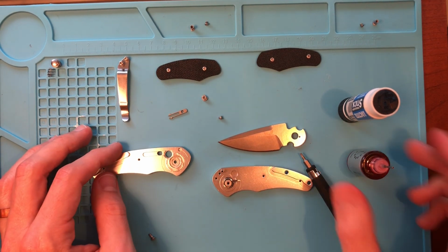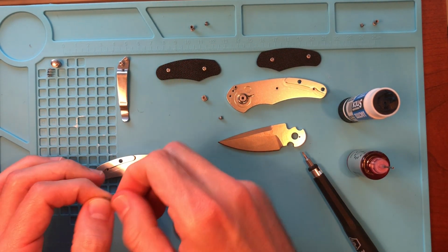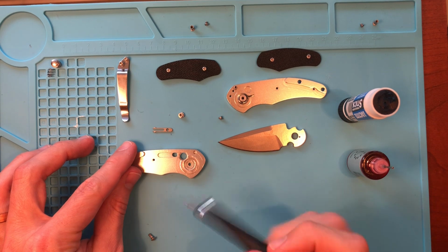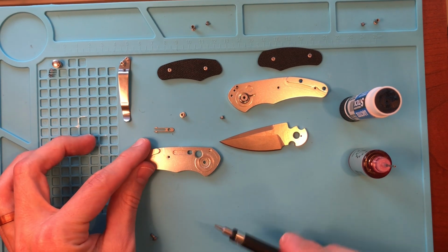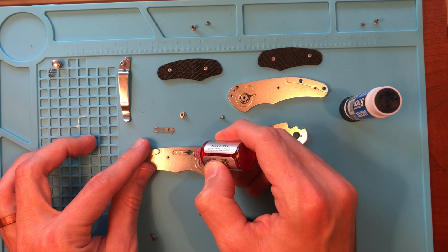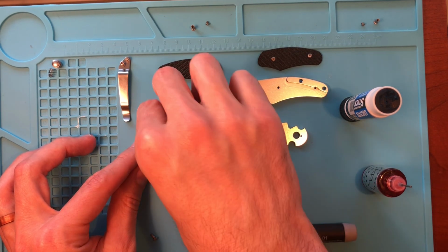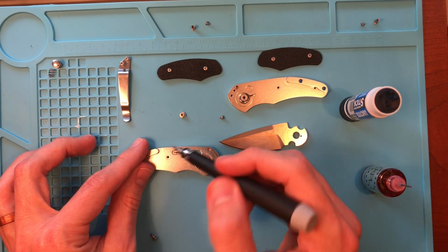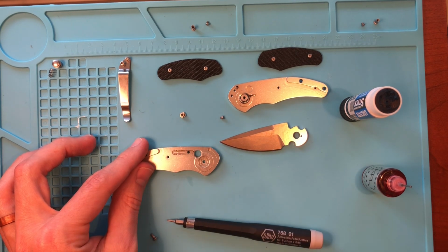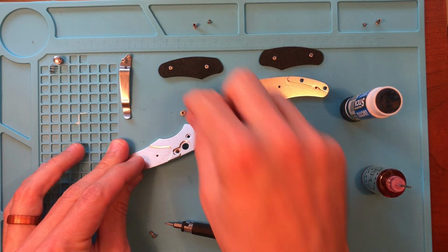All right, the next one to probably put back in, move this stuff off to the side, is your safety slide mechanism here. So it's a few pieces, and this piece here actually rides in this little groove or channel here. So again, I lubricate everything, but this is another point that I put some KPL lube on there, and then if you keep it back so those ears fit in the opening, this just goes right back here, and then you can click it right down in there. So just like so. Now it'll kind of hold itself in there, and you can flip it over.